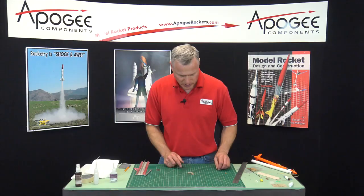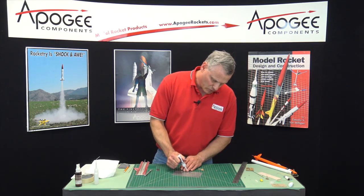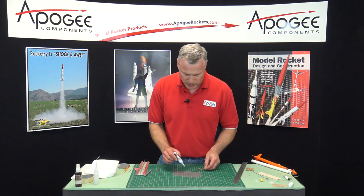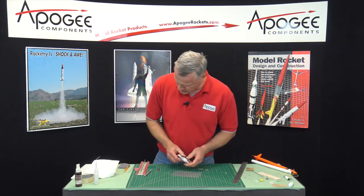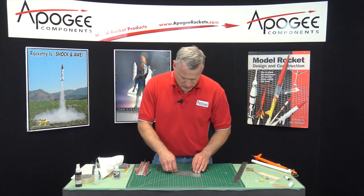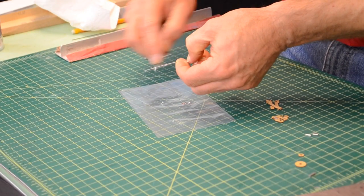I've got those three pieces plus the hub and the three little aluminum tubes. Now, this is the tricky part. I want you to take a piece of plastic and put a drop of thick super glue onto the plastic. Because we're not going to put the super glue directly against the part — the super glue is going to go everywhere and get into that little corner there, making it hard to snap off. I've got a little piece of music wire here that I'm going to use kind of like a toothpick to pick up glue and put it exactly where I want.